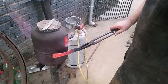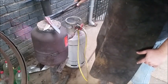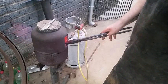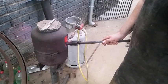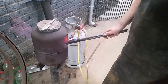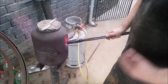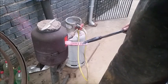I've got half of the tang done, which is fine. So I'm going to turn it around. I'm going to put the blade all the way through so the tip sticks out the other side, so we can get this section heated up properly. The reason I'm not doing any cuts is because you should see exactly how long it takes. You can see the temperature going up and starting to bleed into the front, which is exactly what you're looking for. Remember: low and slow. This is our key phrase — low and slow. Now you can see the temperature is starting to soak into the blade.